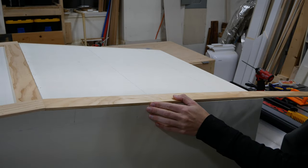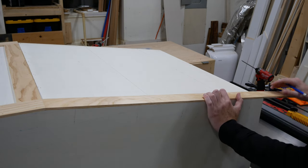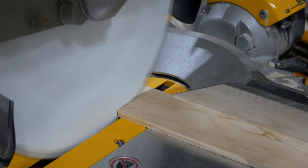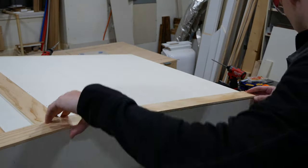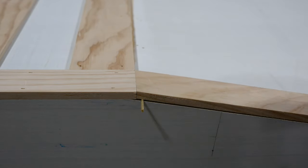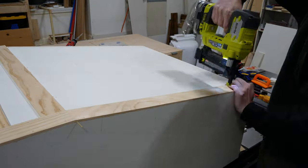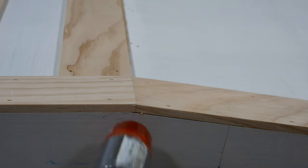Now that it sits flush I set it in place, mark the top edge noting the direction of the angle on the side of the trim, and then cut it off. Then I glued the strip and set it in place. It didn't line up perfectly with the trim below so I shimmed it up slightly with a wooden toothpick and tacked that trim in place. I went back and broke off the toothpick, then tapped the end with a hammer to drive it flush with the side of the hood.